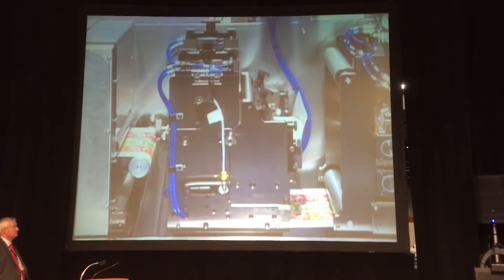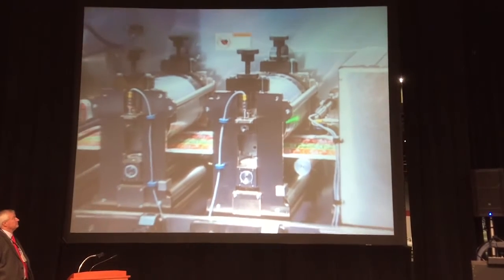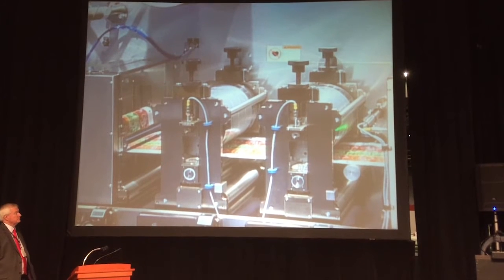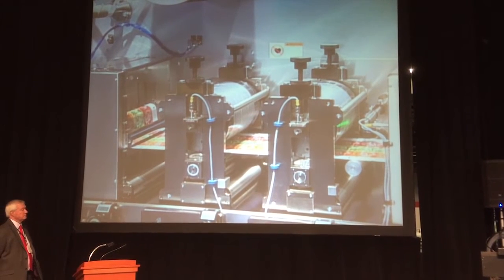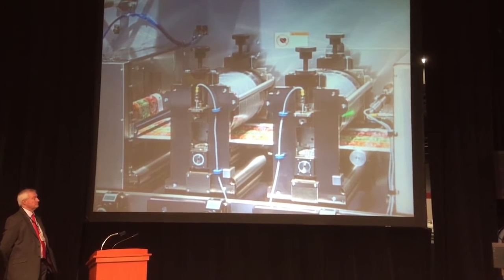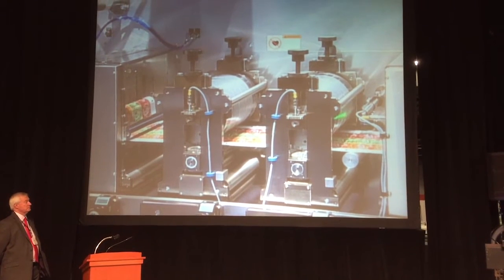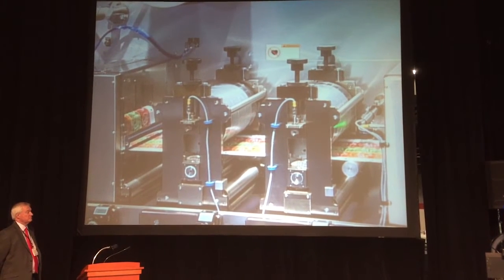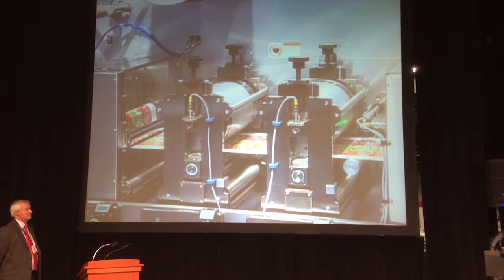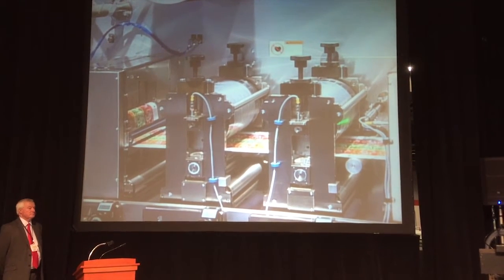When we get into Stations 3 through 6, that is the semi-rotary cutting. This is new — not a new technology to semi-rotary cutting, but we're pushed to go to higher speeds with this. The previous version of the Delta semi-rotary modules would go about 150 feet per minute; these ones go up to 300. What's nice is customers that have version 1 or version 2 can upgrade by just buying these two modules. You don't have to trade in your machine — you can just upgrade it.